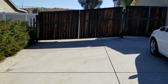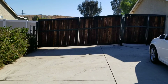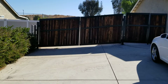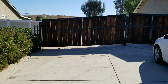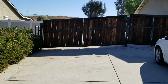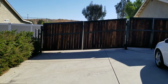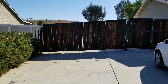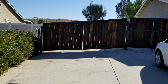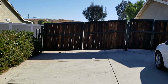and so it makes a rolling gate impossible, and with the house being right here, the only thing I could do is either a single or double gate. A single gate that long on a slope, I thought, might put a lot of stress on the hinges, and it would be really heavy. I might also have trouble with an opener opening it. It's a 16-foot gate. The opener might open it fine, but I thought it'd be better if I relieved it with something not so stressful. Then maybe I won't be changing openers all the time.